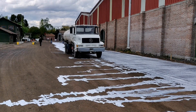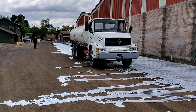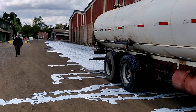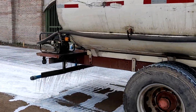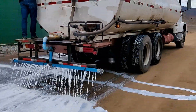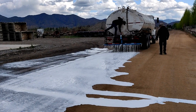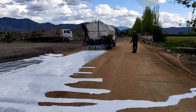Make sure you don't go too fast with the water truck operator, because if you go too fast you're going to get a lot of bald spots and those are going to become your weak points — that's where you get your potholes and eroded spots. See how slow he's going. The fluid is white and milky. If you notice, it's not even going in now — everything is staying on the surface. Don't worry: if you look at the left side of the water truck, it's already beginning to get absorbed, just at a much slower pace. If you see a lot running to the side, you can always broom it back in using a broom or brush.